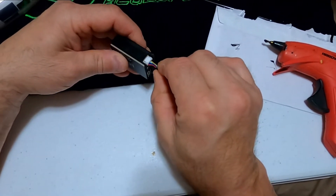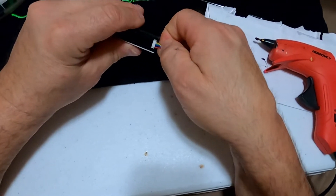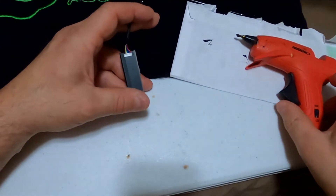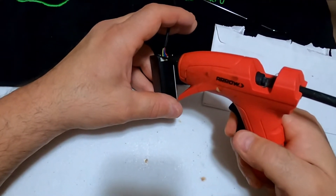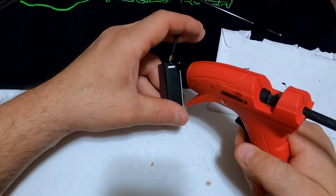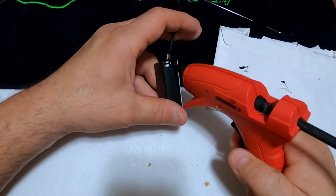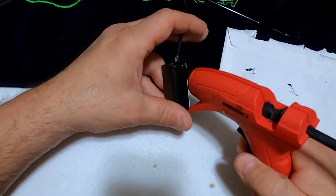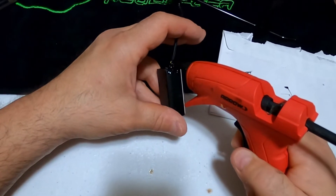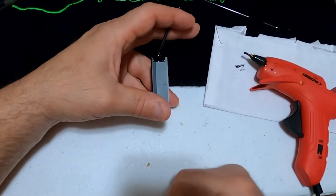Let me plug this in — plug it into your controller and you'll hear a click. Now everybody's thinking, 'Oh, that's beautiful, it's plugged in.' Well, I don't take any chances, so let's get the hot glue. I want to hot glue the wires. This is kind of molten rubber so it's going to roll into those wires, and then I'm going to come across the top so the wires are actually held to the connector. Let me wipe the spider webs.